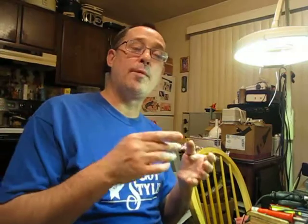Now that would be the type of switch you could think of as if you were using it on your doorbell or your car horn. Well, this normally closed push button switch would be always on. Your doorbell would be going ding dong like crazy until you press that switch, and then that breaks the circuit. It's normally closed. When you press the switch, it opens it up, and that would of course break the connection, and it would cease to be active or beeping. You get a moment's rest until you release the switch, and then it would continue.